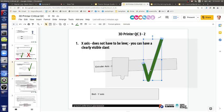And the thing you have to pay attention to: if it was hardly stuck, if it was there just by gravity, and you had no force on it, that would still work. But that's not how it works in reality. If you have a little blob, a little filament of plastic that your nozzle actually hits, that's where you have to have good adhesion. Sometimes I notice when you print, your head is actually hitting the print because it didn't get the initial bed leveling correct, but it doesn't necessarily fail, because if the prints still stick, it will kind of ride up on them and bump a little bit, but it will actually succeed if you have really good adhesion, because that will all wash out the higher up in the print you go. So that's why sticking to the bed is important when you have failures,